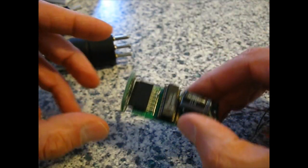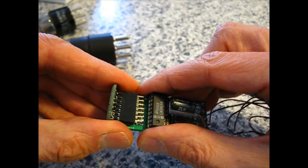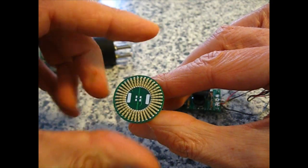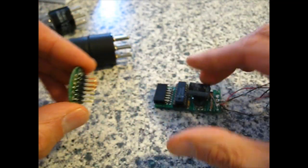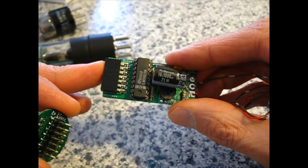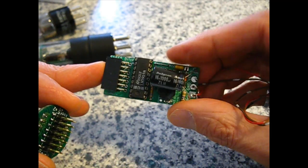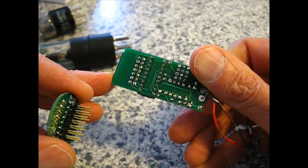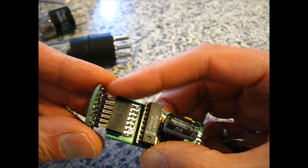That board inside looks like this. The board consists of two pieces: the actual LED array, which is 120 LEDs on a custom surface mount — 0603 LEDs on a custom board with a 14-pin connector on the back. That interfaces with the electronics board, which is a conventional through-hole type board using the LM3915 bar graph IC, an op-amp, a pot for adjusting sensitivity, and a handful of other components. This board is quite straightforward — you don't really need a custom board for this; you can do it with just a perforated board.